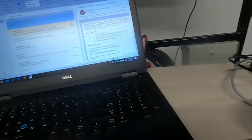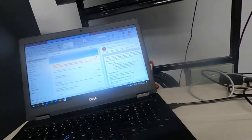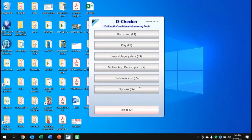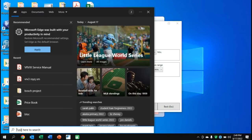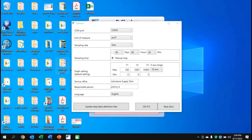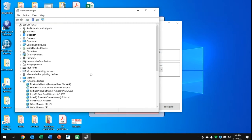I'm going to open a laptop and plug in the USB — it's all loaded up. I'll show how to check drivers if it doesn't appear. When you run the software, you open the D-Checker from the folder. If you go into Options and don't see anything on the COM port — if it's empty — the USB may not have been recognized by the computer. Go into Device Manager. If you're not computer-savvy, get help. This is a Windows 10 machine — I'll look at my COM ports.